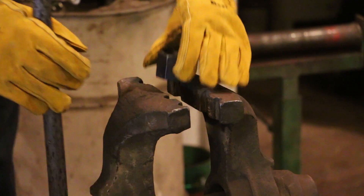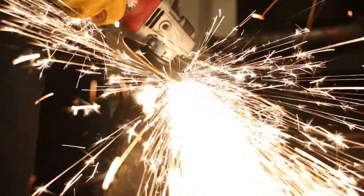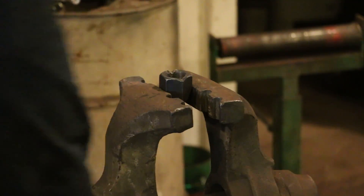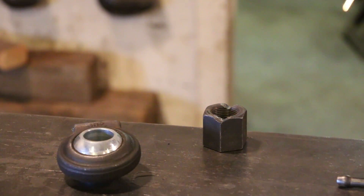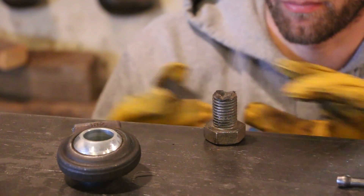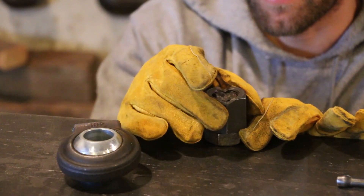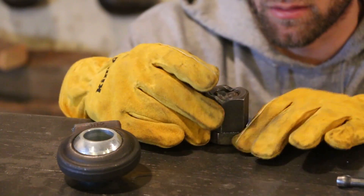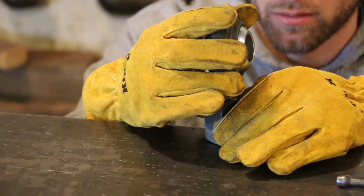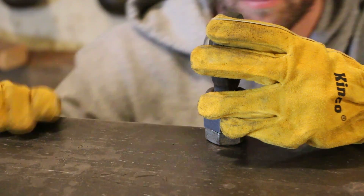I used a ball from a tractor three-point hitch and also picked up a coupling nut that would screw on to the end of the rod. I put a little notch in it that I thought would help the swivel sit down into it and keep it centered. I was worried about slag getting down on the threads of the nut when I welded it, so I grabbed a bolt to sit inside and fill the space up, which would hopefully keep the threads clean. Once I was happy with the position I clamped it all down — kind of a balancing act but it wasn't too bad.